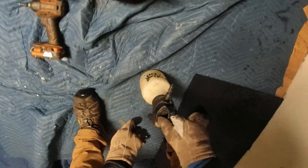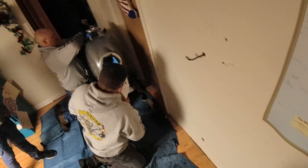Here we're right in the middle of rolling the liner into the inversion drum and clamping it onto the nozzle in preparation for inflating it into the host sewer pipe.